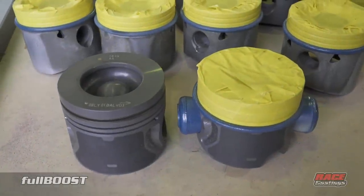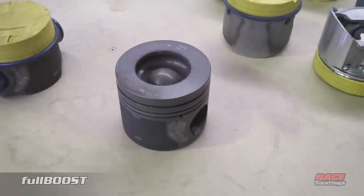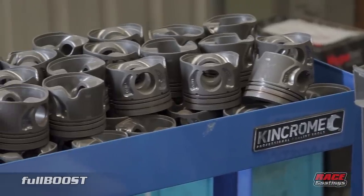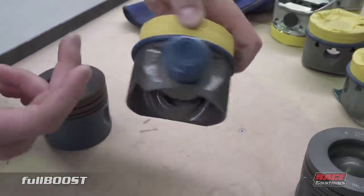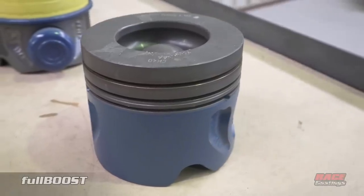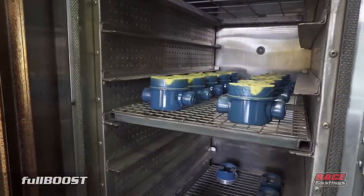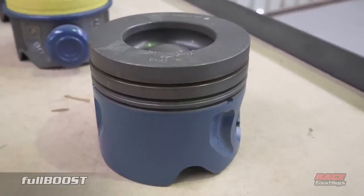Here's a brand new diesel piston off the BT50 and Ford Ranger. After a rebuild, what we do here is improve the bore-to-piston clearance. We sandblast and etch through the skirt section, then apply the Teflon coating on the side skirts, which is blue in colour. It's a very durable product — once it's been in a car for 30,000 to 60,000 kilometres, you will not get any scratching on that bore at all.